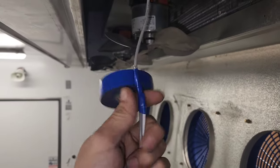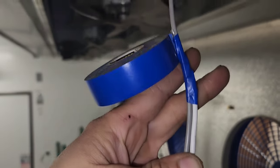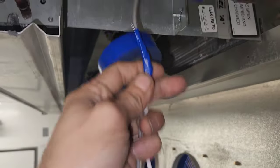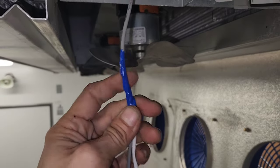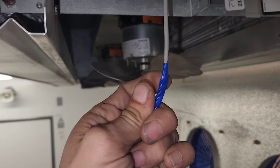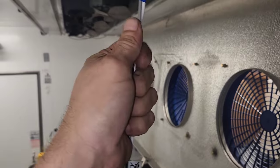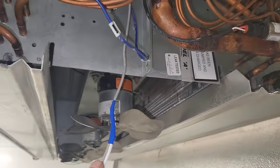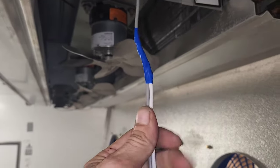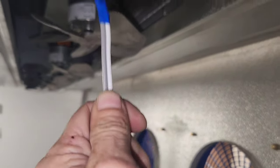Let me know what y'all think about that. Now what I like to do to chase wires or get wires where they need to go — I'll put them together. You see how this is: you've got the wire that's going through, you've got to pull that wire through anyway, so if you attach the other one on it and then make it come to a nice little point with the tape — where there's not very much resistance that it's going to encounter on its journey — you'll have really good chances of getting it through. And if it's somewhere that you don't want it, you can tape it more. It's best to get your tape as close as possible, as tight as possible, and make good contact with what you're taping.